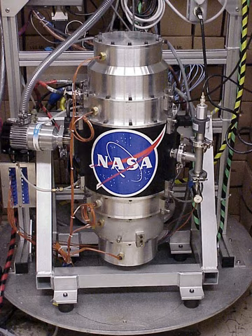The high specific energies often cited with flywheels can be a little misleading, as commercial systems built have much lower specific energy — for example, 11 watt-hours per kilogram, or 40 kilojoules per kilogram.